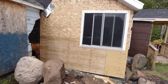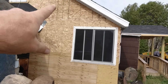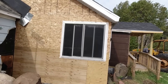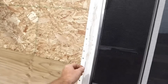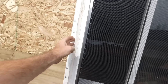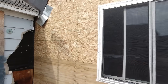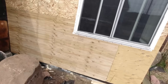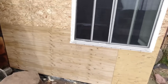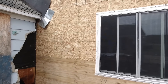It's not quite finished but it's pretty good — it needs the stuff around the window. The window is actually out where it should be, so there don't need to be any wood board. I got a lot of caulk to pull off, but the J-trim will sit right up against the siding and you won't have wood boards along there that rot and need painting. It's got tar paper underneath the whole wall.